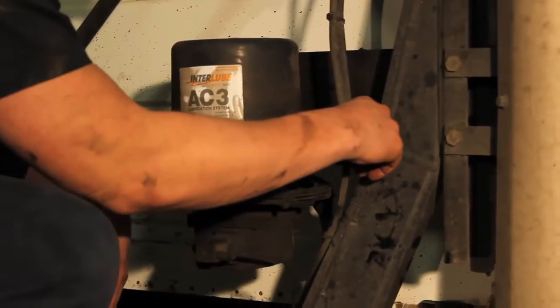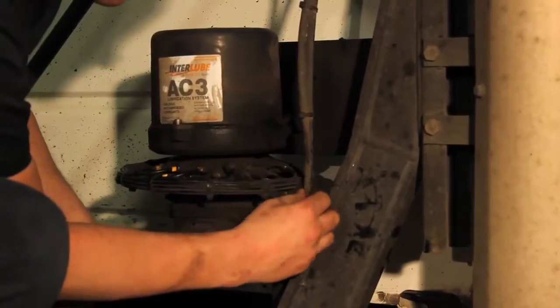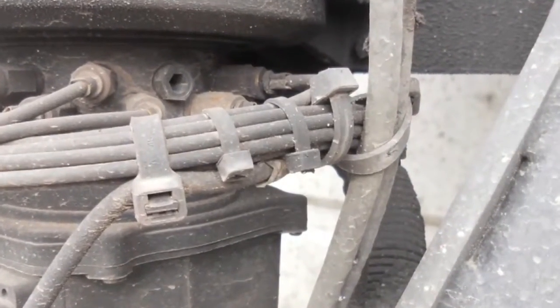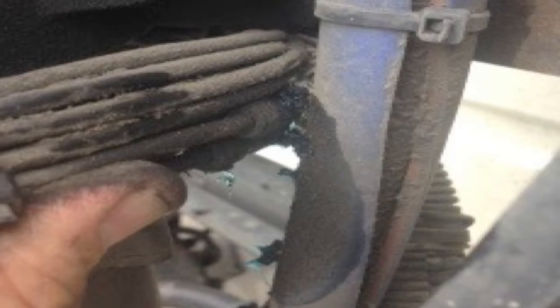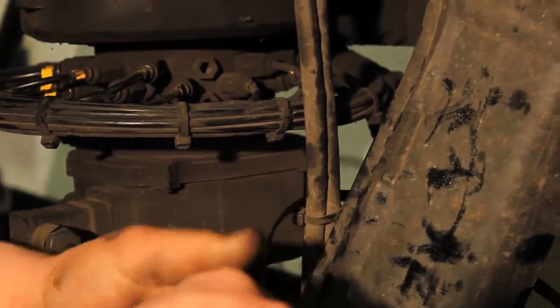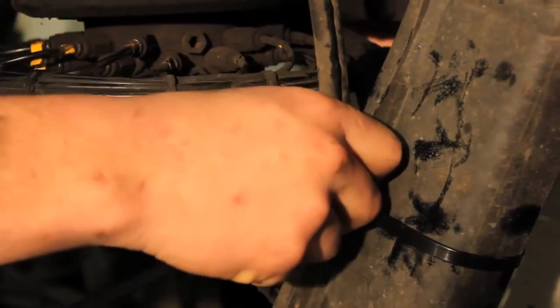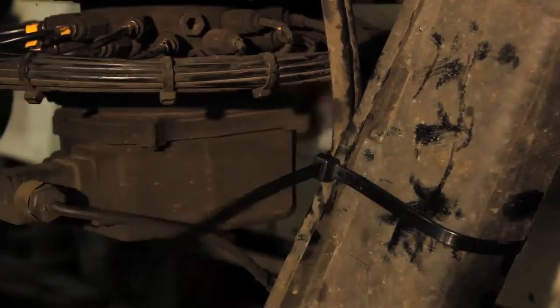Lines that are connected to or rubbing against other chassis components could become worn and leak. In this example, lines from the oil filtration system were secured to the grease lines, resulting in rubbing damage and worn grease lines. You may have to reposition some lines to avoid unwanted contact with other chassis components. Worn or damaged lines should be repaired or replaced.